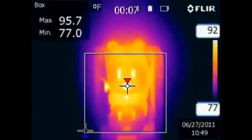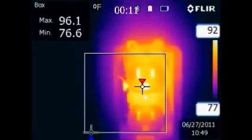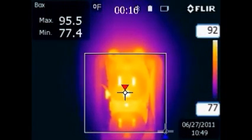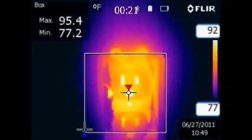This section reveals hidden dangers you may not know even exist. Most receptacles are parallel fed, with multiple receptacles on one circuit, including your lighting loads too. As seen in this section, the temperature rise is due to a loose connection parallel feeding another receptacle.